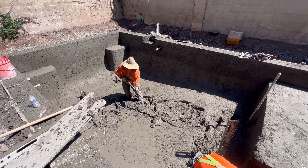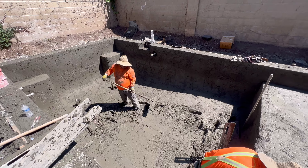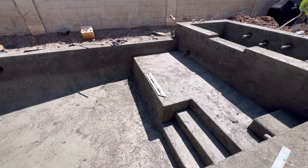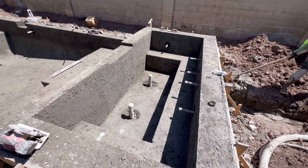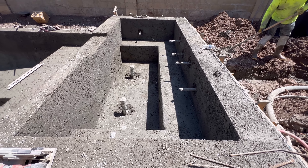Here you can see the steps in the baja shelf — he's checking the width and making sure dimensions are dialed in. They use tools to shape the shotcrete: basically a trowel, plus a tool in his left hand that's almost like an aluminum screed to keep a nice straight edge on the steps. Then he takes his trowel and floats out the shotcrete. The other guy is getting the floor settled, moving the mud around and getting it all shaped properly.